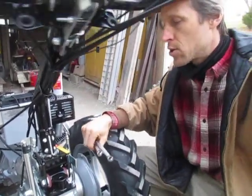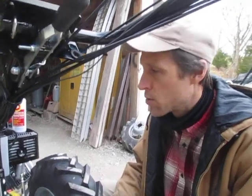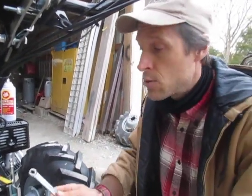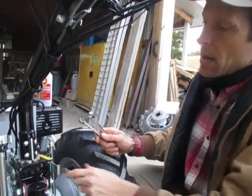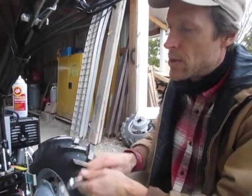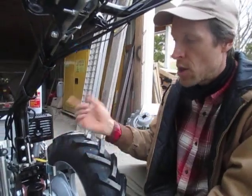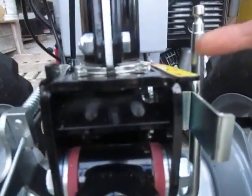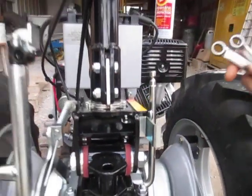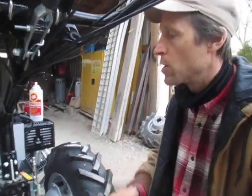This is good — I can still move them easily but there's a little resistance, so they're tightened properly. But if you let a tractor go five or ten years and never adjust those, the handlebars get really loose. And if they get loose enough, it can actually seriously wear things — especially the smart reversing system on the G110 and some old G107 machines, which automatically inverts the function of the reverser when you turn the handlebars around. That's operated by a couple of small stamped steel gears, and if the handles get super sloppy, those gears can slip and you get out of time on your reverser adjustments. I'd say once a year is a good time to do it when you're doing the once-over on the tractor.